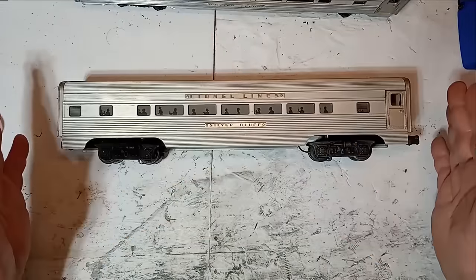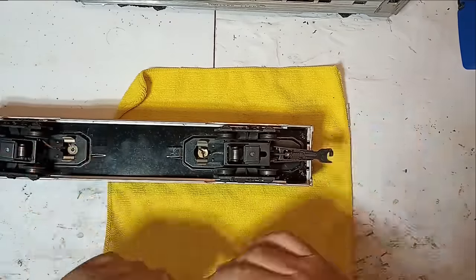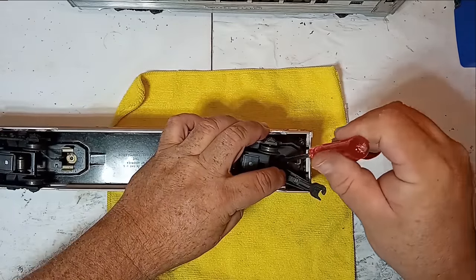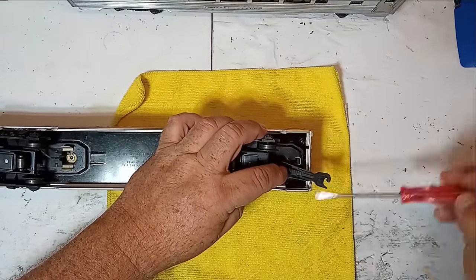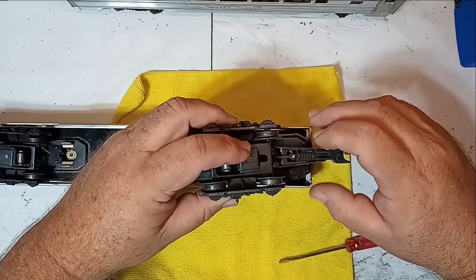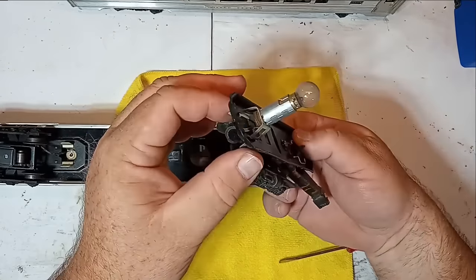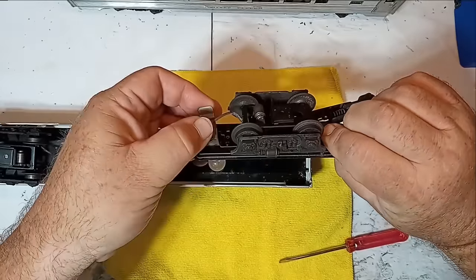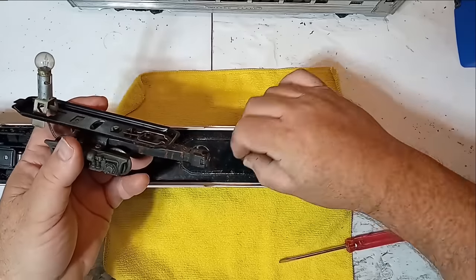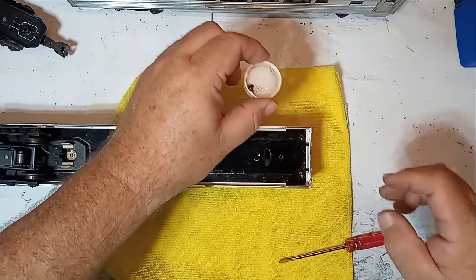The first part of the process is to disassemble the car so we don't have to worry about breaking anything. And this comes in handy if you ever need to replace a light bulb — you don't have to take the car completely apart. We're going to just remove this one screw here. This is actually brilliant Lionel engineering: each of these trucks with the lights is a self-contained unit with the light bulb and everything, so there's no additional wiring to worry about in the car. You can change the light bulb just by pulling the plug, but if you need to get in here, just one screw and the whole truck assembly comes off — pretty nifty.